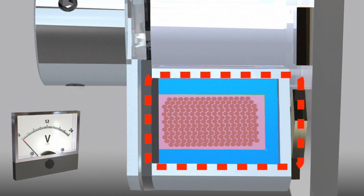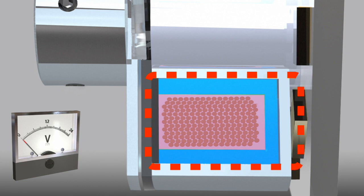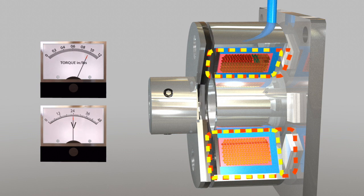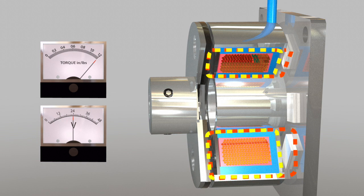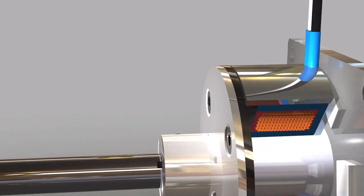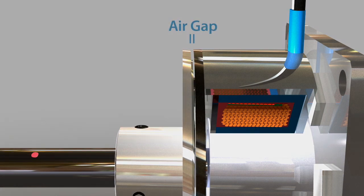When the power is removed from the coil, the magnetic flux created by the permanent magnets in the base of the brake is free to travel through the coil shell, creating a magnetic attraction between the coil shell and the armature. Conversely, if the brake coil's polarity is the same as the permanent magnets, then the magnetic field becomes amplified, and the flux from the permanent magnet and the coil becomes additive, and the brake torque can be boosted by up to 100%. Since the hub is attached to the armature, the hub and the shaft going through the hub are either dynamically stopped or held in place.